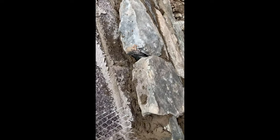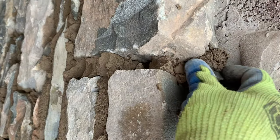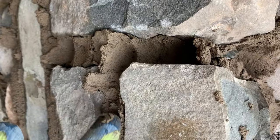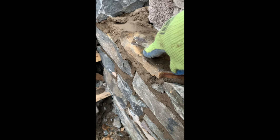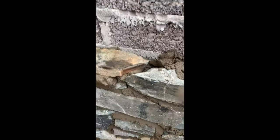This is important when you're building any type of stone — you need to have a decent mixture of mortar, preferably lime mortar; this is cement. You need a good mixture of mortar and stone, so you want to be pushing your pinners into the middle of the wall. It just forces mortar into all the crevices and makes it properly solid. Building stones in like this always gives a nice decent bit of bonding and makes it stronger. Remember, a backfill is always a decent amount of mortar and stones.